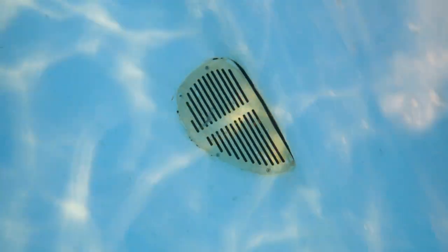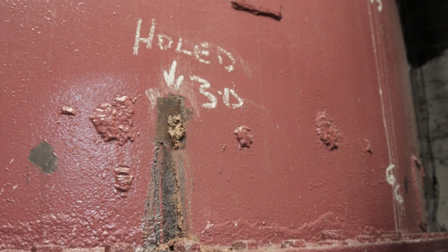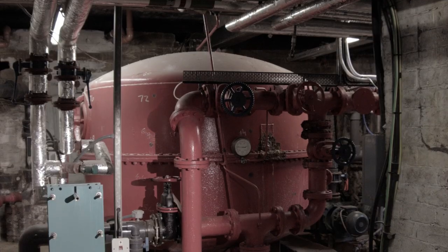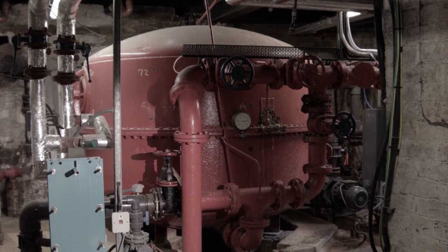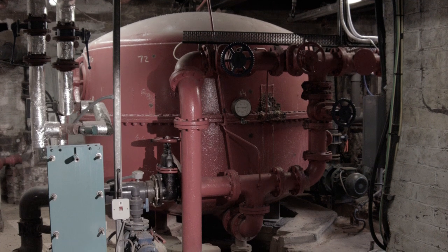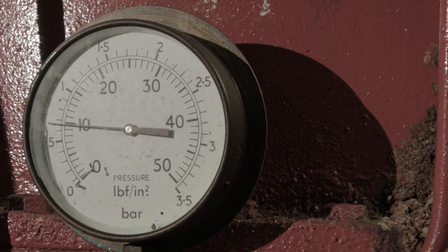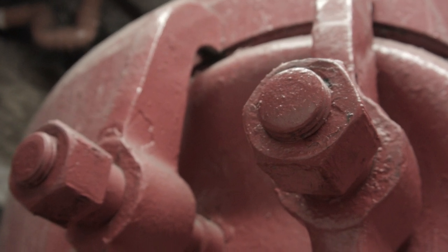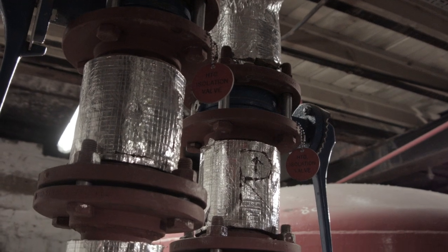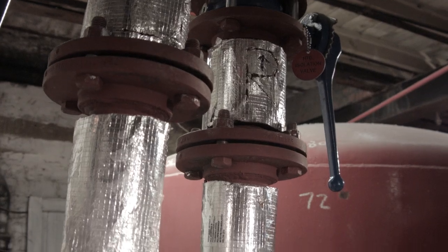Obviously, you'll never see a filter like the one down the stair. The steel in the filter would have been good steel, because the filters you buy nowadays will not be the same steel. You had what's called a nozzle plate. I still got a nozzle plate at the bottom of the filtration system, underneath your sand. If it had been laterals, that's a cheaper version of a good filtration system. The modern day ones, the laterals in them have pea gravel under it, which is a dead spot, so you breed bacteria. So this type's quite a good one.